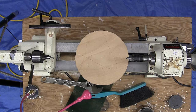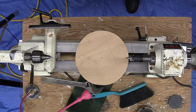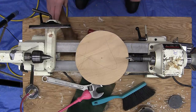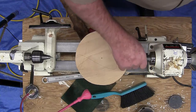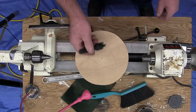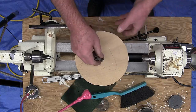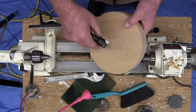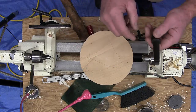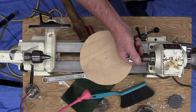Martin said he uses a dead blow hammer to secure his handles because of his arthritis and other afflictions that other people may have. Some people have taken their drive spurs and position them and take a hammer and mash it in place to get an imprint of the spurs onto the workpiece so that it'll get a better grip. That's not a good idea because you end up mushrooming out the small end of the taper. It will not fit in there anymore.